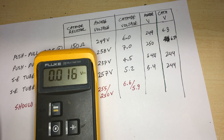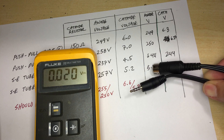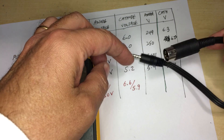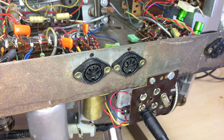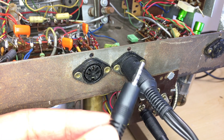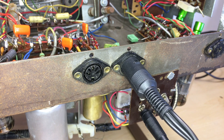I was quite fortunate to find a connector — a 3.5mm jack plug with four connectors. The one nearest the base is usually a microphone contact on iPhone-type connectors, but it's not used here. You have your stereo connectors, and on the other end a DIN five-prong plug that connects exactly to the gramophone input on this radio. I've verified that the tip and ring of the stereo plug connect to the correct points. We do have a bit of a problem here to do with the quality of the previous repair.